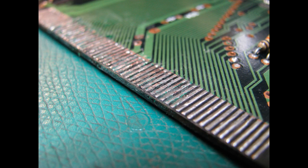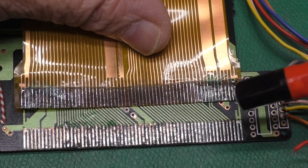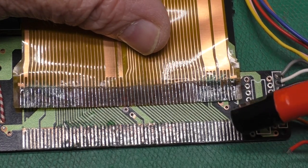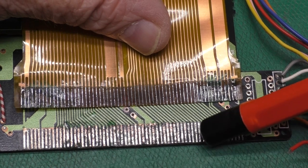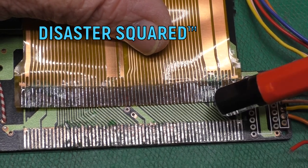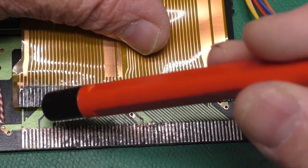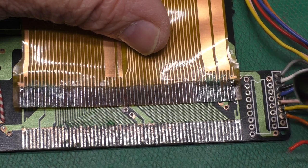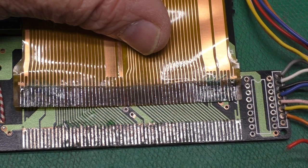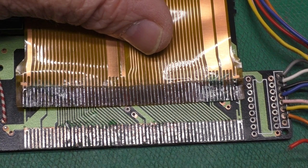After getting everything glued down, I tried to use a no clean flux to tin the pads, and had a second disaster. The flux dissolved the epoxy, and I had to try to glue things down again. After three attempts, the pads were in bad shape, and the chances of success were slim. All these pads were mostly stuck back down — I had stuck them down with the epoxy, and then tried to tin them, and found out that the no clean flux I was trying to use actually dissolved the epoxy, which was quite a disaster. So I cleaned all that up, glued them back down again with the epoxy, and I will just use regular rosin flux now. I give this maybe a 25% chance of working — I'm not too confident in it, but at this point it's a learning experience.